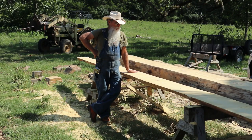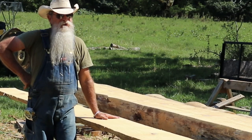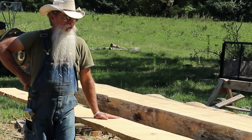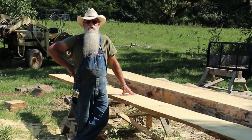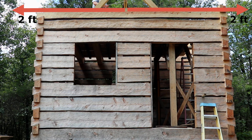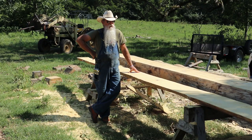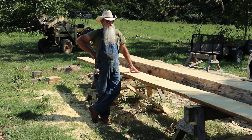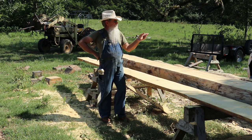I've been milling a log or two today — well, actually only one. This is going to be one of the top plates. I didn't have anything long enough left in the log yard; I only had two 18-foot logs left. With the extension going past the end of the cabin, I want at least two feet of overhang on the gable ends, so I needed something longer. I went to the mill and they had some long logs — been laying for a while, but still good and solid. I got two of them and brought them home. I've got one milled out on both sides, and I've got another one over here.